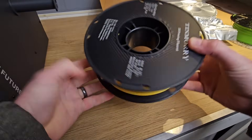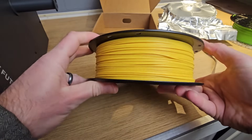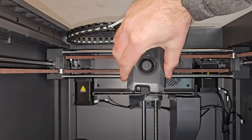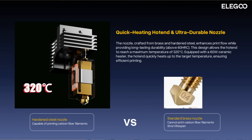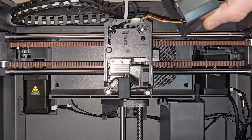After this, I decided to try some other materials and Timori had recently sent me some of their PETG-GF filament — PETG but with glass fibres added, which changes its characteristics. As the Centauri Carbon has a hardened steel nozzle, printing with these abrasive filaments shouldn't be an issue. Brass nozzles used to be the norm in 3D printers and brass is great for conducting heat, but unfortunately it isn't very wear resistant. Elegoo have used a hybrid nozzle that should give us the best of both worlds — it's brass but with a hardened steel tip, which means it should last a long time and be better at conducting heat to the filament. The hot end can also reach 320 degrees, which would allow you to print with some engineering filaments, but there is a bit of a limitation there which I'll get to.